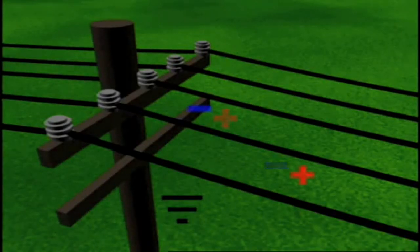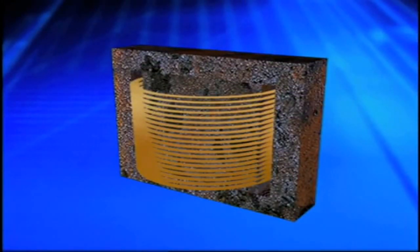The electromagnetically induced voltage, however, cannot be completely discharged, even if grounds are placed on both ends. The reason why this is so is because the energized conductor acts as the primary winding of a transformer, and the de-energized conductor acts as the secondary winding, creating a transformer with a one-to-one ratio. A low value of mutual inductance is created.